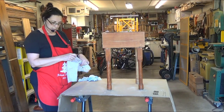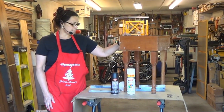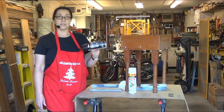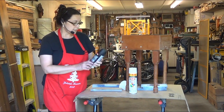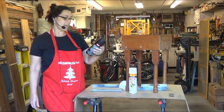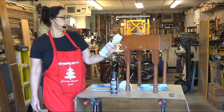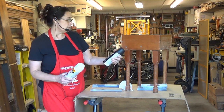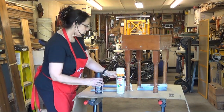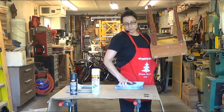I'm going to clean up my area now, get this propped up on some blocks, and we'll come back and I'll show you how to spray paint it. Okay, I've got it wiped down and I'm ready to start spray painting. The first thing you want to do with your spray paints is whatever brand you're using, you're going to have to shake them up for a couple of minutes to get the paint mixed up well in the can. I'm going to paint the hinges with Krylon black matte max ultimate coverage — number 9198 matte black. I prefer matte spray paints, but I didn't have a matte for my table so I'm going to use a satin ivory Krylon — number 3443 satin ivory — it has paint and primer mixed in and is an indoor/outdoor paint. The first thing I want to do before I paint is flip the table over because I don't want paint getting inside — it's really just easier to flip it over — and put it raised up on a couple of blocks of wood.